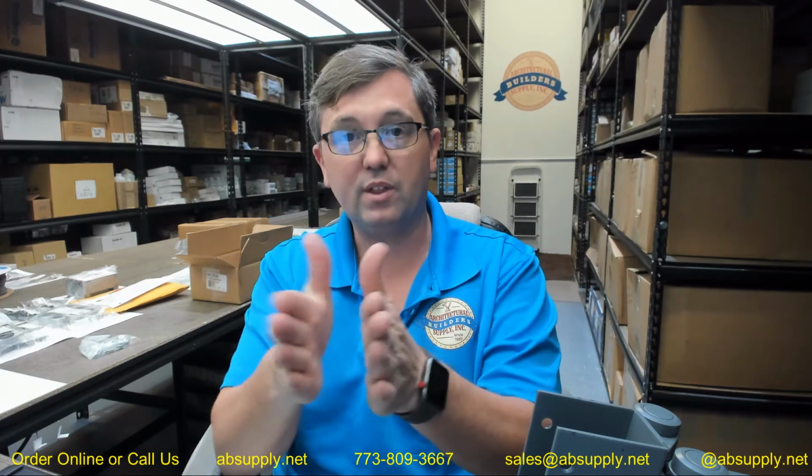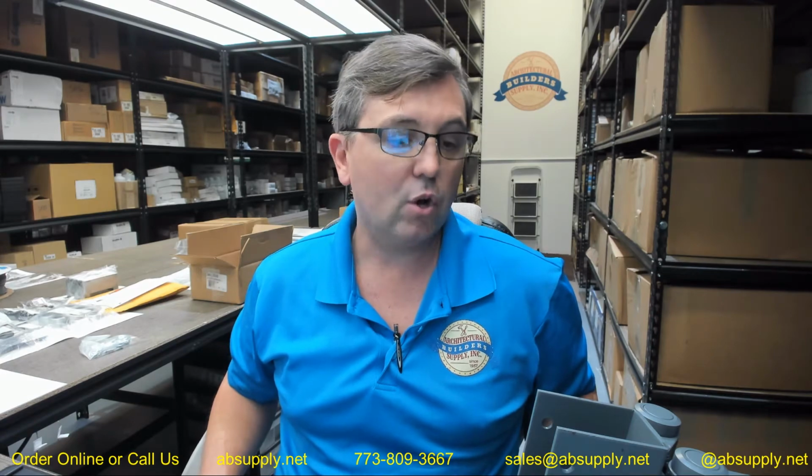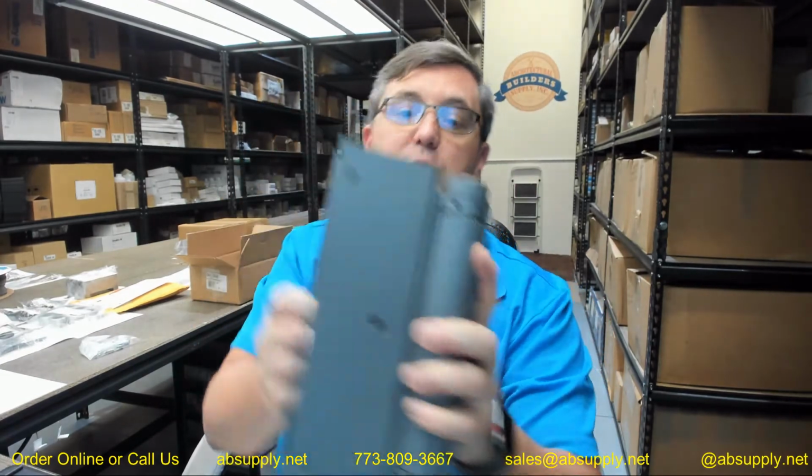Clamp flanges are not adjustable, meaning you can't play with the door thickness. They are literally made to order in all instances. I don't see any reason why you can't ask them for a 2 1/8 inch door thickness. Not at all. They're obviously just going to be shearing some steel and putting it into a press brake, would be my guess. This material is always made to order 100% of the time.